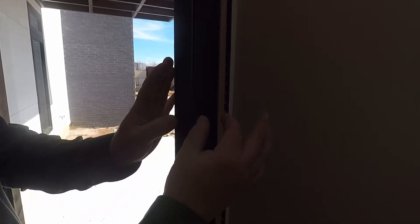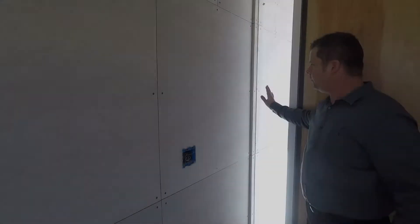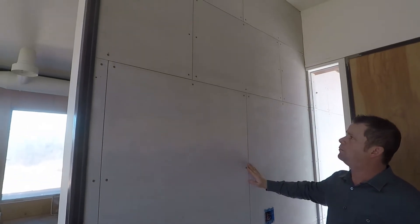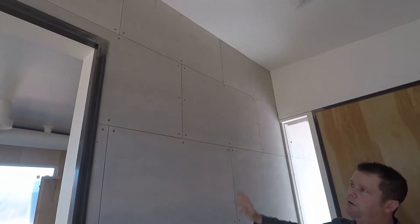For you carpenters that are interested, this is actually an inch and three-eighths solid core birch door. I made these two steel angle iron frames and it's sandwiched in there. Then I've got the tongue and groove siding on the outside. So I finished it about two and a quarter — it continues from outside in here. We just got some exposed fasteners; they're kind of on a pattern that we thought went with the look.